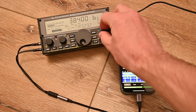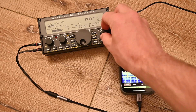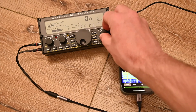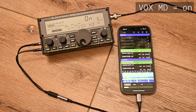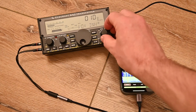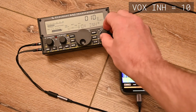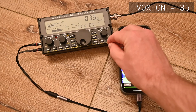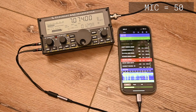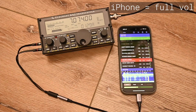The other thing you have to do — and you'll notice we didn't have any CAT connected — is go over here and turn on VOX mode. It's actually using just keying off the audio from the iPhone to determine when to transmit. For my setting, I found that an inhibit value of about 10 is pretty good, a VOX gain of about 35 is pretty good, and my mic is set to about 50, which is what the iPhone turned up to full volume.